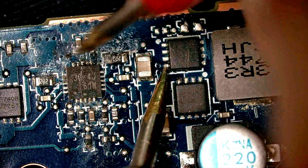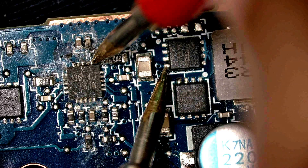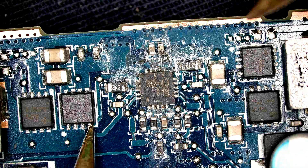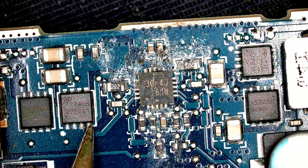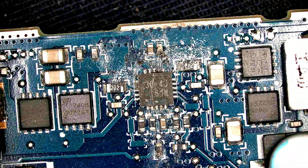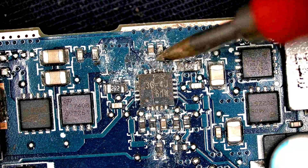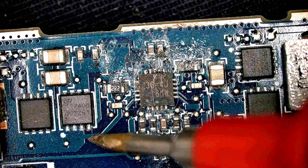Let's see which pin is working for that. This is the gate, connected with this pin, and another side here. This one also gate, and this is connected with this. This IC is not working because it is burned — you can see the ash here. But 5 volt and 3.3 volt are still working.